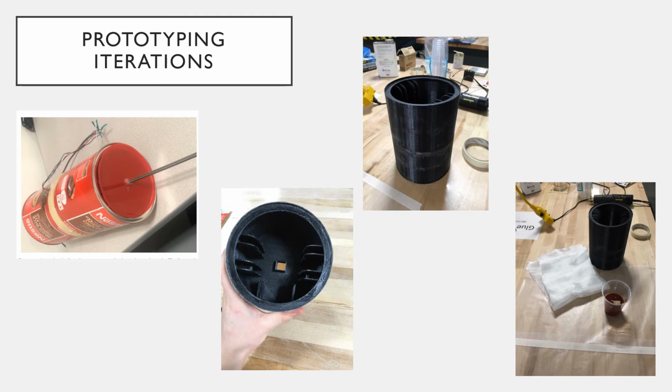A foam coating was then installed on the outside along with 3D printed attachments. The foam provided insulation and padding, while the attachment provided a location to secure the capsule to the balloon. A lot of prototyping had to be precise since there was a limited budget and all the parts had to work with little margin of error.